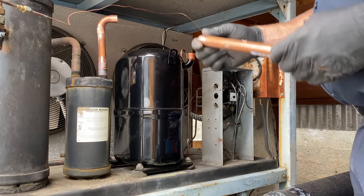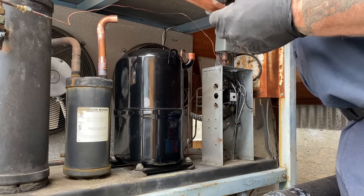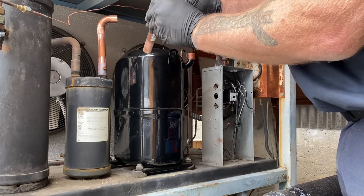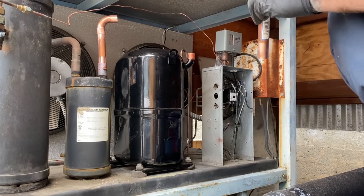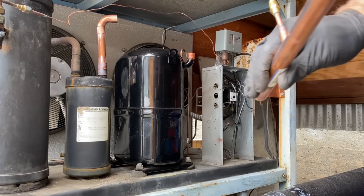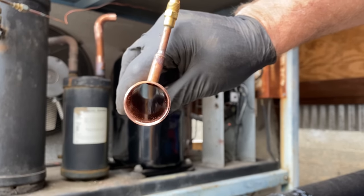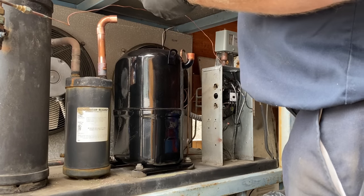Okay. Now we can clean the pipe out because it's not in the system or brazed on the system. Then this is going to fit in there like a glove. Look at that. It's going to fit in there just like a glove, baby, without sticking down in there and impeding the flow of refrigerant. So now I can clean the pipe out. Okay, look, you can look inside of here if I can get the camera lined up right. Yeah, so there's no impediment, no debris. You clean it out real good, and you can do that before it's all part of the system.